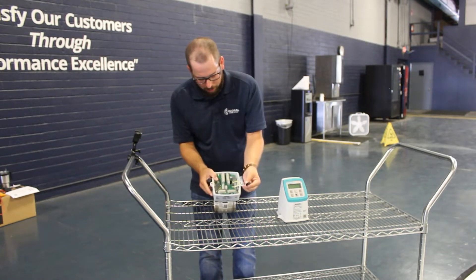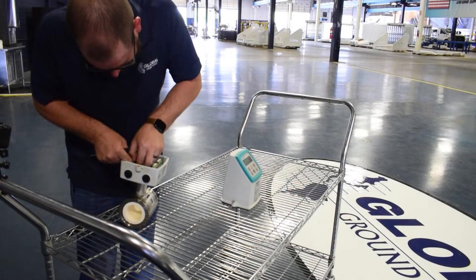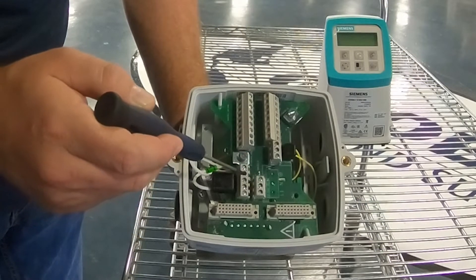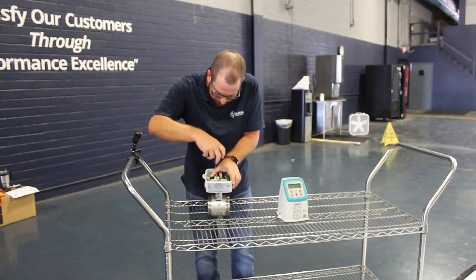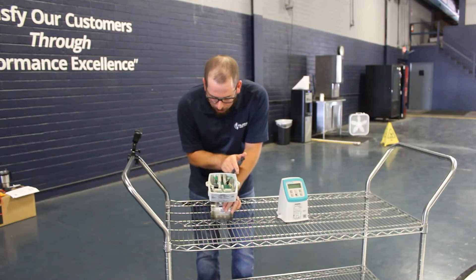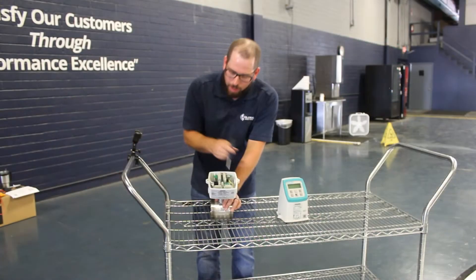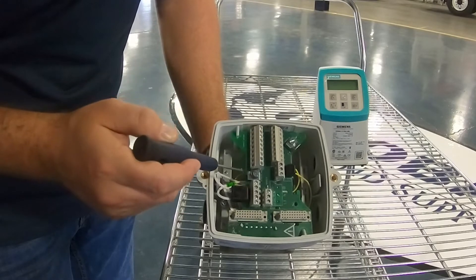This is our sensor power and it gets installed on the other side on terminals 82, 0, and 83. You also want to run power to the 12-volt input and the ground. For most of our de-icers we use what's called the passive output, and that is terminals 57, 58, and then this shield right here.